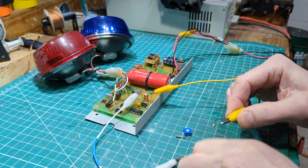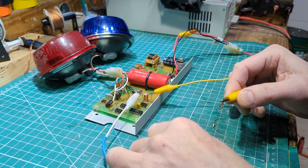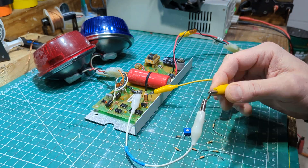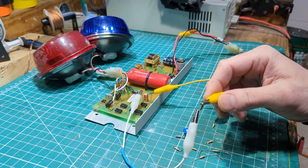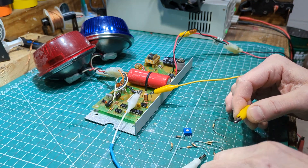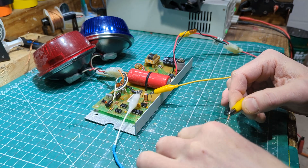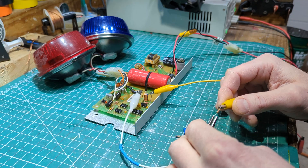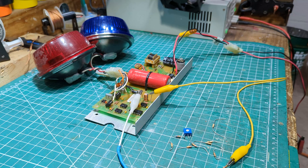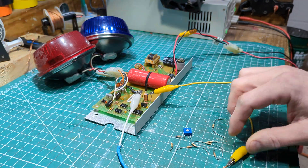You can see what the cycle would be, or you can do what I'm doing and just play around with it. Ultimately, throwing a potentiometer in there is going to be the most sensitive way to adjust it — that's why Whelan used them on a lot of their boards. They don't use one on this board because they're really just going for a max-ish speed, so they can just plug in a resistor that's close to that.